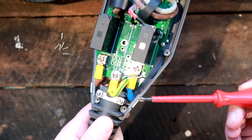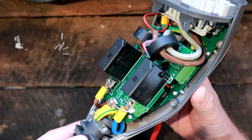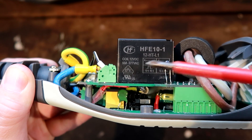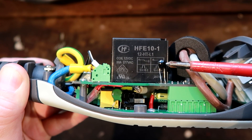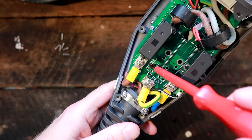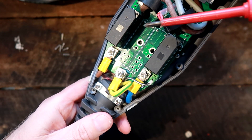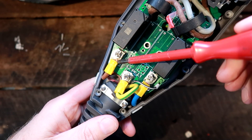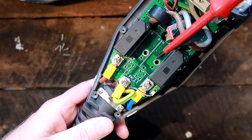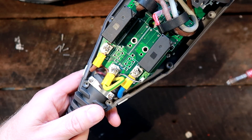At first glance we can see the thick cable here — six square millimeter cables, which is very good for the 32-amp maximum current. We've got two relays in here rated at 12 volts and 50 amps, and also a temperature sensor. We've got the neutral, L1, L2, and L3. While this is only a single-phase prototype charger, we've only got the neutral and L3 active. In the three-phase version there will be two more contactors here which will connect or disconnect all three actives and the neutral at the same time.